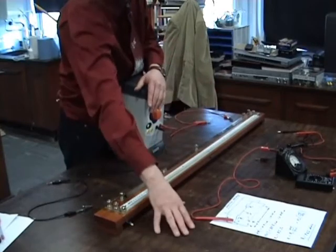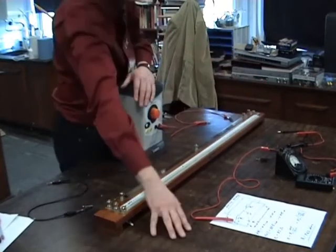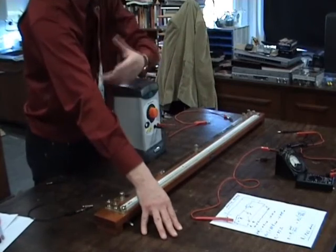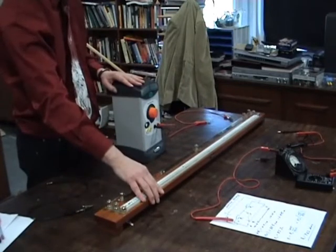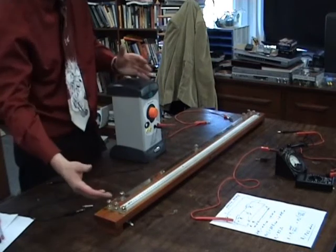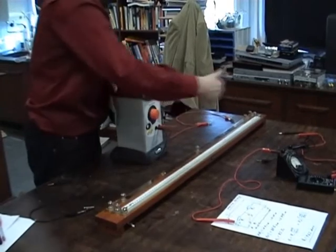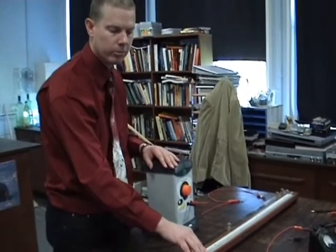So whatever appliance you've got it hooked up to, it will detect whether the current is going one way or the other — in one way it will realize the temperature is too low and might turn on a heater; in the other scenario it will realize the current is going the other way, therefore the temperature is too high, and it will turn off the heater or turn on the cooler. So you can use this as a thermostat, as some sort of temperature control system in a house. Alternatively, you can just have it as some sort of fire alarm — if the temperature increases by 30 degrees, you'll certainly get a current going through it, and again, that can be used to activate an alarm.